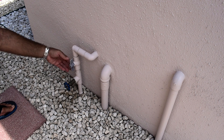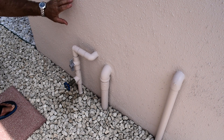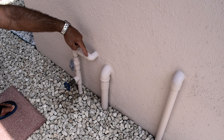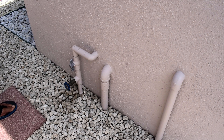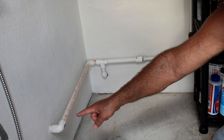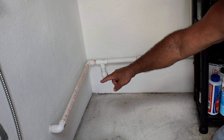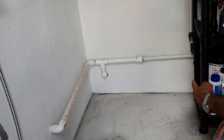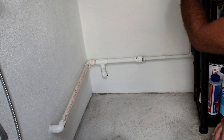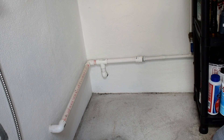There's a hose bib before the shutoff. If I didn't have an inside room where this goes to, I would come straight up and that's where my connections would be made, just above the city water going back into the house - it would be mounted outside on the wall. Because this goes through the wall into a concrete utility room, I'm going to be mounting the two-stage filter on the opposite side. I do not want to put the filtration system near the hose bib, because I don't want my hose bib having filtered water. So I'm going to make a cut right after the tee, and make a cut right over here where it becomes half inch, then come straight up with a three-quarter line that ties into the filter.